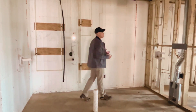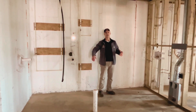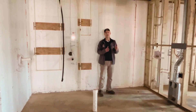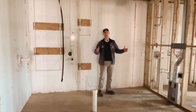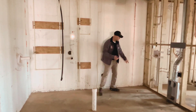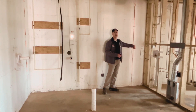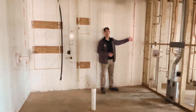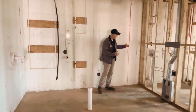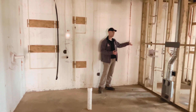As we slide down the wall, sometimes we get asked about how you handle your common seam. In any wall segment of an ICF wall, you've got four foot blocks. You don't always have a wall segment that is perfectly matched with the four foot segment, so you have to cut somewhere. What you want is what's called a common seam — from top to bottom, one common seam. We come off each corner to this point and this is our common seam. You'll see where we use our orange foam spray glue to actually seal it. We'll come back prior to drywall, take a rasp, and cut this flat right before the drywall goes on. This is an indication of a common seam along this foundation wall.